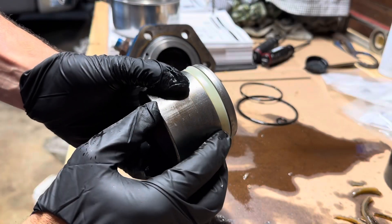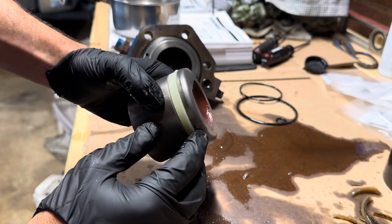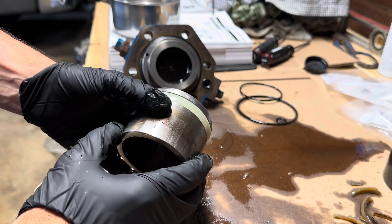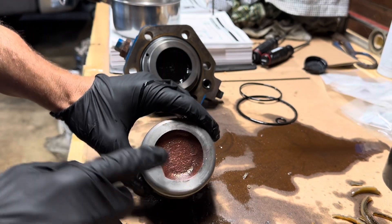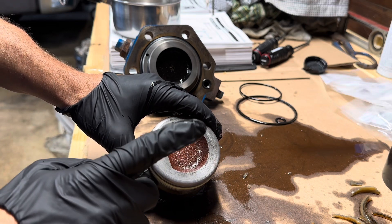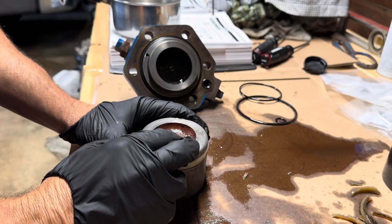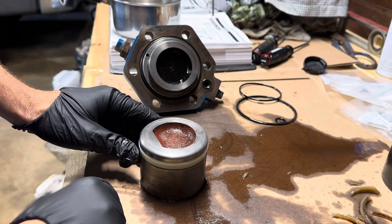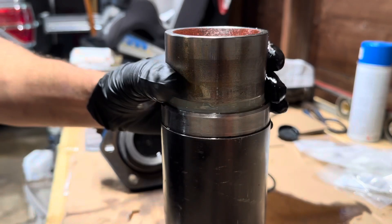The lip with the open channel of the seal is on this side, which is toward where the head of this cylinder is. So at this point we're now ready to reassemble the sleeve with the head and get this piston in. Note that we have a flat spot here — we have to make sure that's going in the right direction. So what I'm going to do is get the piston in the sleeve, and then after it's in the sleeve I'll put the sleeve onto the head, making sure the alignment on this flat part is in the correct position. I've thoroughly oiled this up, but I don't think this is going to go easy.